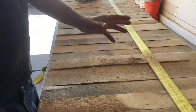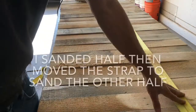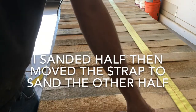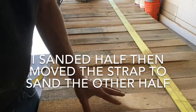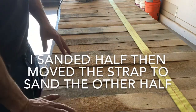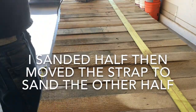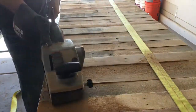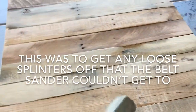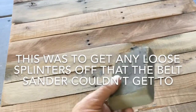Since I don't have a planer, which would be ideal, what I've done is strapped the door down — because I don't have it anchored to anything at this point — so I can run a belt sander on it and get the real high spots off the wood, so the outer trim anchors up to it nicely. Since this pallet wood has so many imperfections, I did a final sand using a foam block because it will contour to the imperfections in the wood.